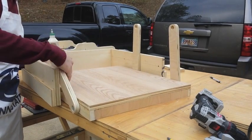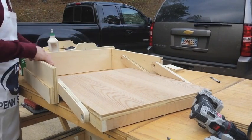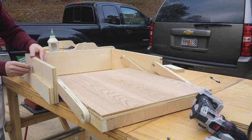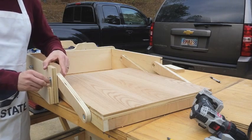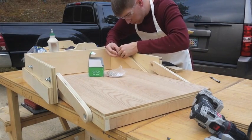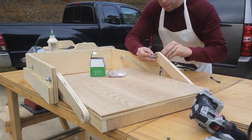The strip of plywood you see near my waist on the outside of the drawer is to mount the drawer glides to. It provides about a 3/4 inch space for the end of the bolt and the nuts that you can see I'm attaching here. It allows for clearance between the drawer and the frame. When I assembled it, I used washers in between everything just to allow for things to glide even when tightened down.